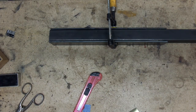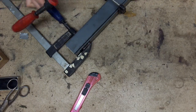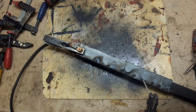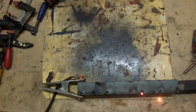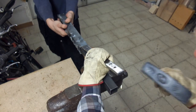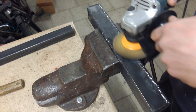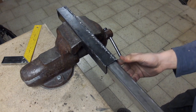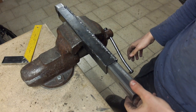The only way to do it is by welding the outer tube from four individual pieces. When you are welding, you have to be extremely careful not to overheat one spot locally, because the tube will bend. Instead, you want to do little welds, jump from left to right, rotate the tube as much as possible — basically try to heat it up uniformly. Because then it will just expand and shrink, which you don't mind, but it will not bend. But it still happened to me — it was hard to get it out and I wasn't able to move it. So I had to spend about an hour grinding the inner tube, trying to make the fit better. And this is the result.